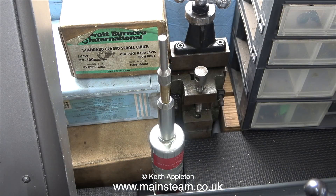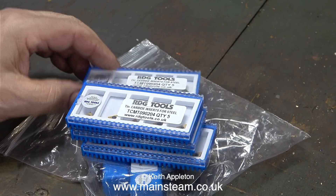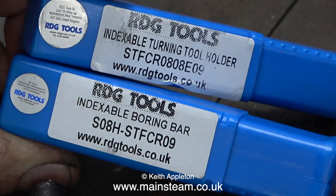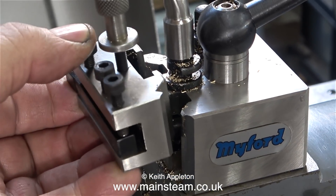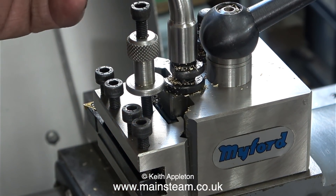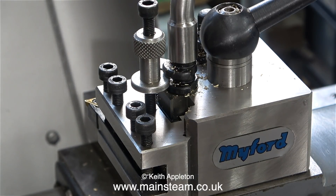I've found a perfect spot to keep the oil gun just behind the lathe by the tailstock. Coincidentally, carbide tips and two tools that take those carbide tips arrived in the post on the same day. For the type of jobs I'm going to do on this Myford I only need three tools: a general cutting tool, a boring bar, and a chamfering tool also known as a V tool. I won't bother with a parting tool — if I want to part anything off I'll use one of the other lathes.